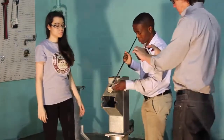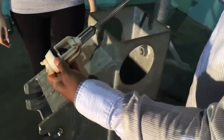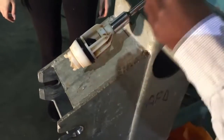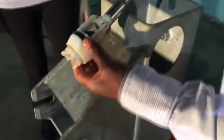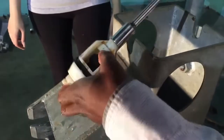There are two check valves in this pump — an upper check valve and a lower check valve. They look very similar. Each of the check valves has a little rubber stopper in it, and you want to make sure that it is there and hasn't been lost. You want to inspect it for cracks or nicks and make sure that it will freely move within the plastic portion. You can just take your finger and move it back and forth and see that it freely moves.